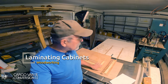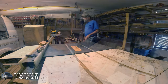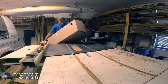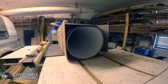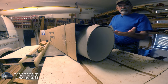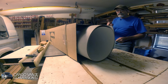I started working on the cabinet doors — cut it all out of half an inch plywood, so I've got a few pieces for two closets and more to do, and now I'll be covering them with Formica. I ordered three more 4x8 sheets of Formica laminate and that arrives in a fairly small box. I got three sheets, two different types — both white, the same white color. For the inner sides I use the matte, more resistance against fingerprints. On the outside, because of how it looks, I have a glossy finish. This one is the matte and then two glossies as well. There's also a price difference but that's another story.